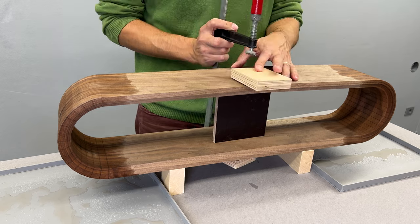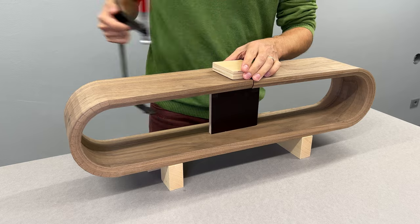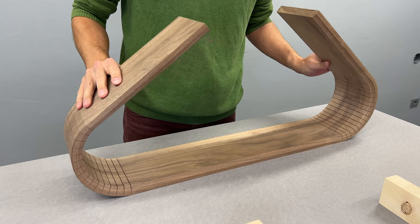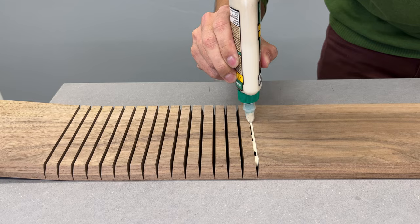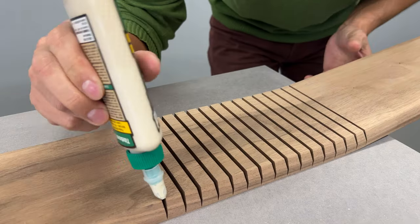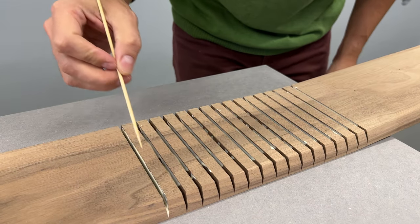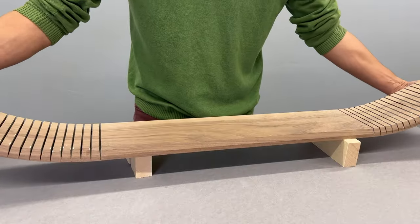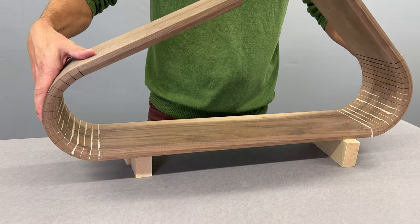I clamped it and left it to dry overnight. When the wood was dry, I clamped and folded it back for gluing. Once again, I was stoked that not a single wood crack sound was heard. I used Titebond 3 wood glue because it has the longest assembly time of all my wood glues. I didn't want to gamble on the glue spreading on its own, so I passed all cuts with a bamboo stick to spread the glue out, ensuring a perfect glue-up.